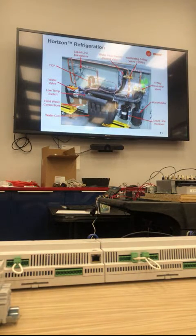And this is just a really nice water source heat pump that we built a couple weeks ago. It tells you all the components which you can find. Liquid line pressure transducer, which starts at the top left. Water flow switch. We were talking about it, and we realized we put 2 water flow switches on dual circuit units. We're going to switch to 1, that's all that's needed. We had redundancy for some reason, and it caused issues. And that is a differential pressure switch, so it doesn't have the paddle style in there. It's only measuring pressure and it's factory set. You should not have to touch that switch.